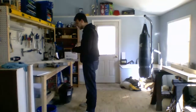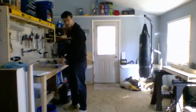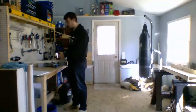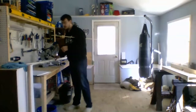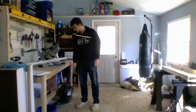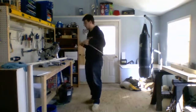In getting ready to set this up, I did realize that I never made a 0 clearance fence for the bottom gap here, so it's possible I'll still get tear outs in this bottom corner. Unfortunately, I don't think I have any plywood to use in there. Project for another day. Nothing to be done about it right now.